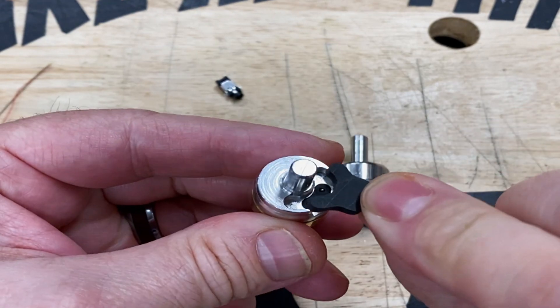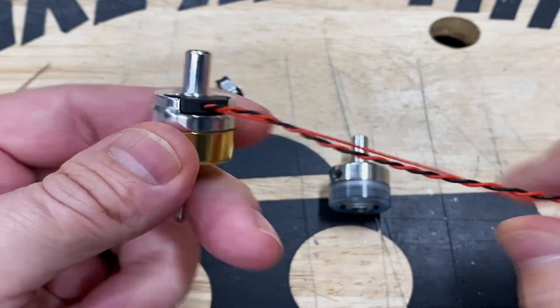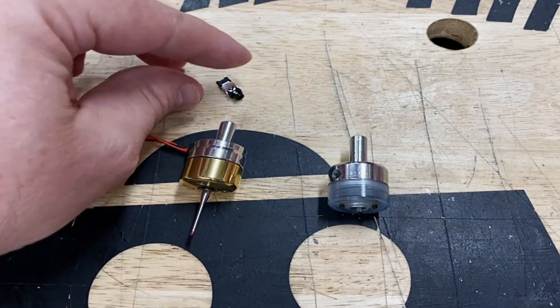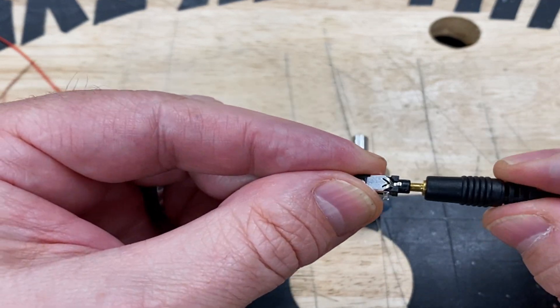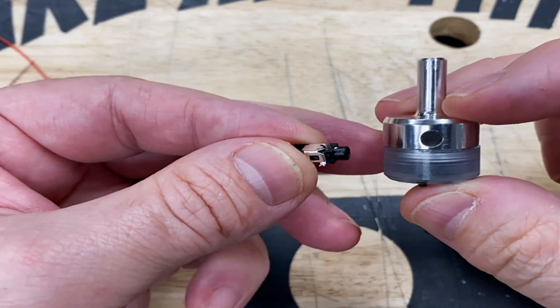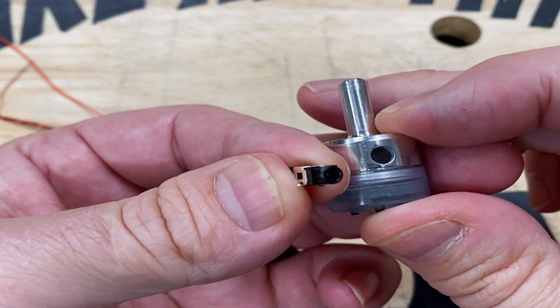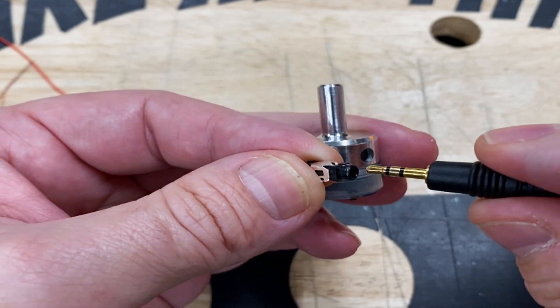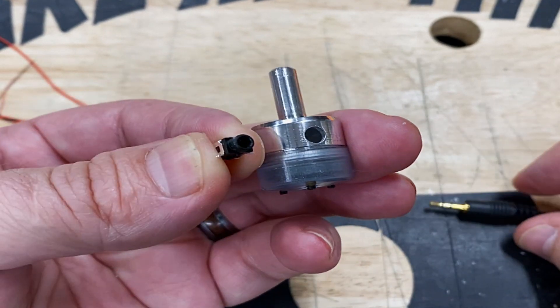Sounds like an easy fix, right? Well, sort of - with the design there were several interdependent needs of the assembly. Changing the platter means addressing those needs as well. Earlier we discussed the complexity of the magnetic connector. If there's any chance of this being reproduced in any quantity, it needs to be simplified. Making it wireless would be the best, but replacing it with a 2.5 millimeter headphone jack would be great - easier to use, easier to install, and would greatly simplify the probe body design. Let's pursue that option for now.